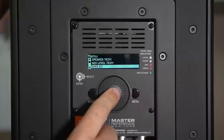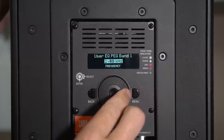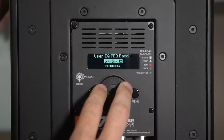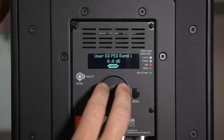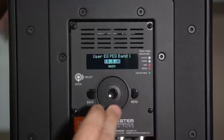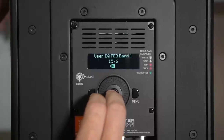User EQ is one of the really nice features outside of room EQ. Right now the frequency is set to 1.81 kHz as just one example — as you move the knob around you've got very fine level of adjustment, probably around one-twelfth octave steps. Then for gain you can go all the way down to minus 12 dB and up to plus 12 dB, so there's a lot of attenuation and boosting availability.